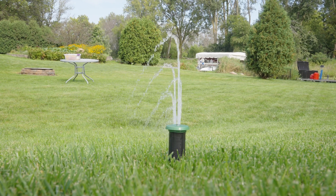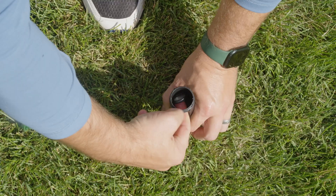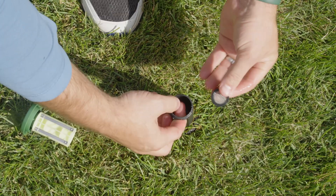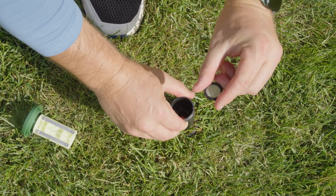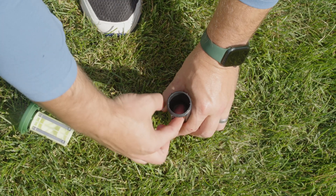The next thing is to check your sprinkler's filter. Using both hands, hold the neck riser up while rotating the green cap counterclockwise. Then pull out the filter below, either from the top or side. No need to get any tools — this whole process can be done by hand.